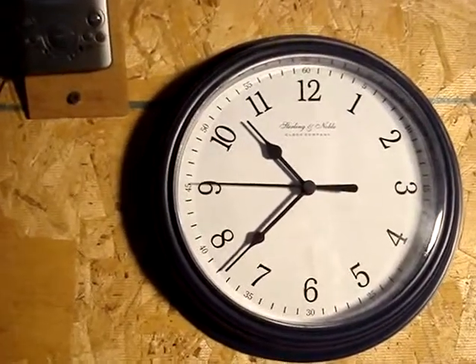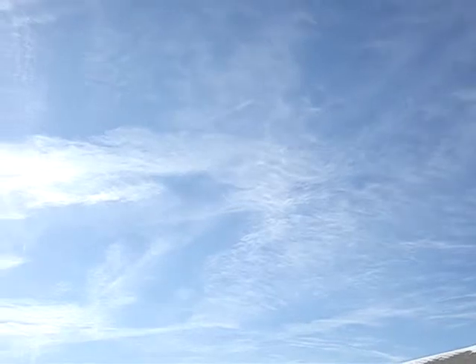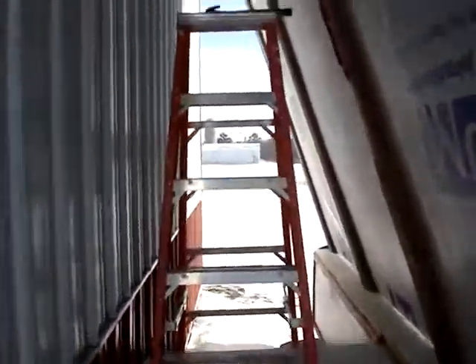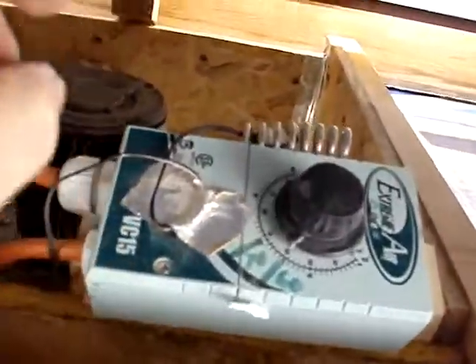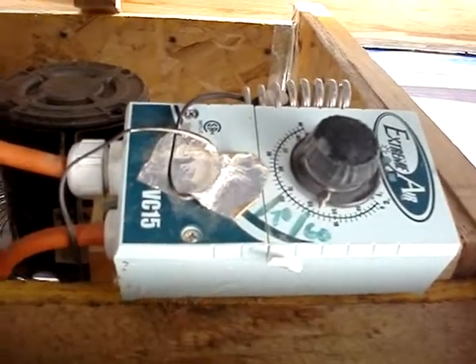Here's a reading after seven minutes of continuous running — 59.2 degrees. Here's our trusty shop buddy Duke. We still have a little bit of haze in the sky. We're going to go to the back side of the panel and set the thermostat down just a little bit. In the middle of winter it's kicking on and off, maintaining about 59 to 60 degrees. There's a little access panel with the thermostat just inside that hole. We'll set it down to about 56 degrees. There's a two-inch slot up on top inside the panel that forms the manifold to distribute air across the top.